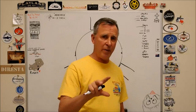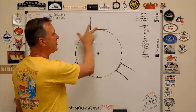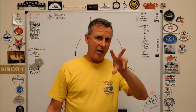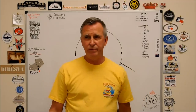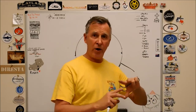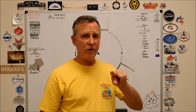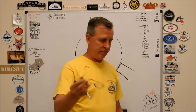If you're trying to true up tubing and you put it in there and you're across the egg-shaped high spot of a tube and you come down, you may influence that tube to the round 3-point contact and come up with a feature that you really weren't hoping to get. So in a light contact for tubing work, rotate it until you find the smallest 3-point contact you can find. It's a safer way and it'll give you a much better feature. Guarantee it.